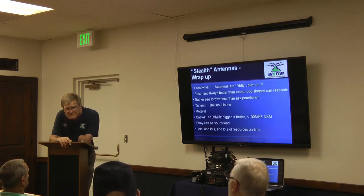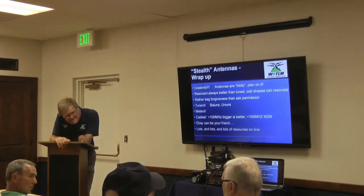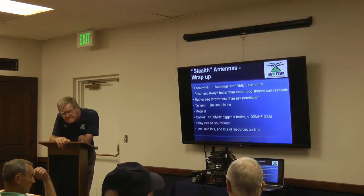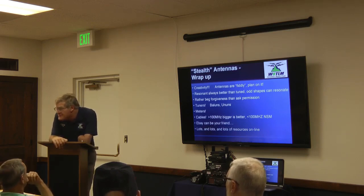It makes a difference. A good company to look at, and it's real easy to remember their name too, because it's a rather novel name, is Fair-Rite, F-A-I-R-R-I-T-E. And they make good RF and microwave capable ferrites. Yep, with relatively low loss. The big issue with ferrites is they can be very lossy. And in some cases, you want ferrites to be lossy because that's what gives you common mode suppression. Just be aware, because it's real tempting. You go on eBay looking for ferrite, and you see these beautiful ferrite cores, and they're gorgeous. They're $6, and they're probably not going to do what you need them to do.